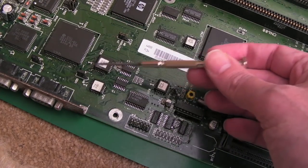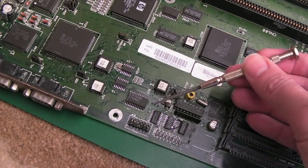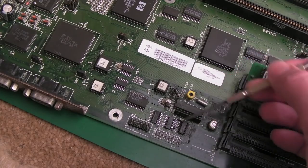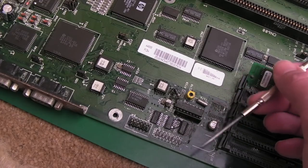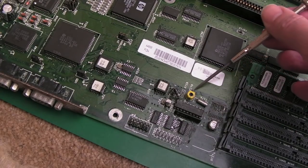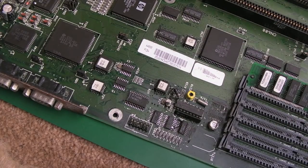So I think the next thing I'm going to do is check all the wires around here, and plug any that need plugging. But I'm going to remove that, because that one hasn't come off. That one's a replacement. That one's the original. Remove that at the same time. Replace those two chips there. Resolder, reflow these. I tested the connectivity there. They're good. And then just continue to check some of the wires around here as well, and some of the ones further afield, because there's some up here that might be causing us some issues. And just see if that makes any difference, really.